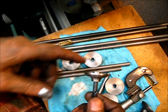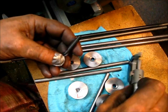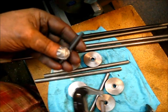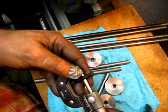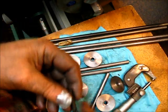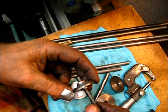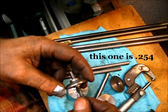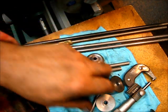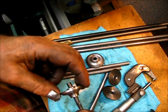The hole that I drilled into the valve head itself with this quarter-inch drill bit — that drill bit mics out at 249 thousandths. It was a good professional-type drill bit. So if you take one of these valves and put it on there, it's a loose fit. I'm going to assume that's about a good thousandths of an inch, so it's 250 thousandths — that gives us a good quarter-inch hole. All of them are about the same amount of looseness, so we can work with that.